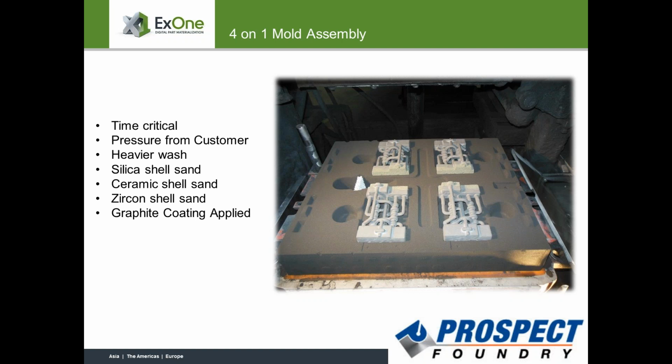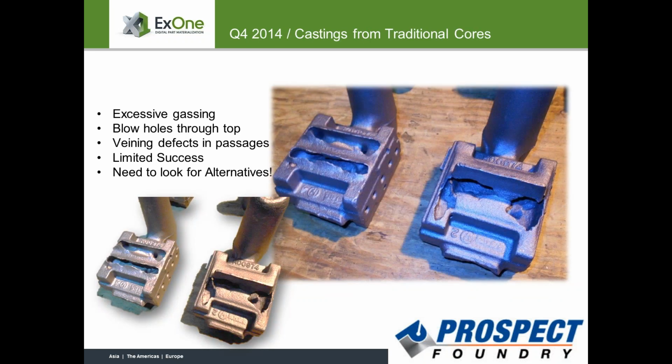And as you'll see in some future slides, the problem with the castings was all the trapped gas that was in there, and Greg related to that. There you go. That's some of our earlier castings that we made with our cores, and all the gas that was generated, because you're pouring iron at 2,600 degrees into a sand mold and surrounding that small little core with all this molten metal, you're creating gas, and that gas has to go somewhere. So with ExOne's process, in discussions with Greg, between the two companies, we came up with the best type of core sand to really pinpoint and eliminate our main problem that we had.